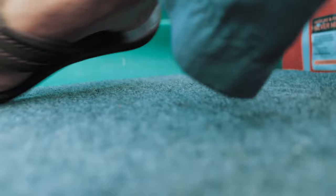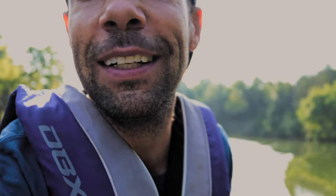Let's go even more aggressive — position five. That front end shoots up a lot; still not planing, still not planing... planing out right now. I'm getting some cavitation in the back — the motor's slipping, the prop sounds like it's cavitating. It might be too high for this boat setup. Front end shot up a lot, motor's not liking this. About 10 seconds to plane out — the motor is not liking this aggressive trim. I think we're one too high.